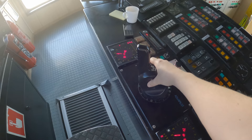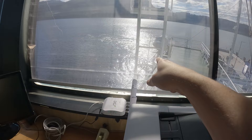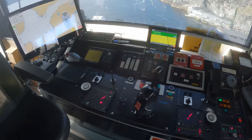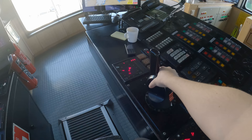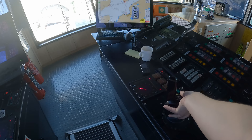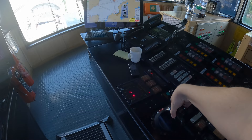When we are navigating or steering the ferry, we use this one right here. Right now we are pushing water out on that side - pushing water from our stern that way. The same applies for this one, we are pushing water this way. When we are sailing, the shuttle stands this way, so we are pushing water right behind us. When we need to reduce our speed quickly, we turn this one so we are pushing water in the opposite direction of driving.